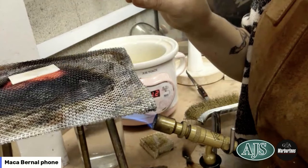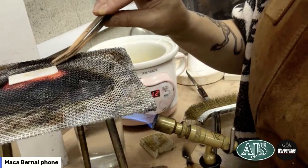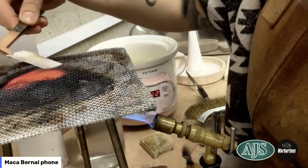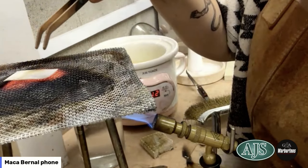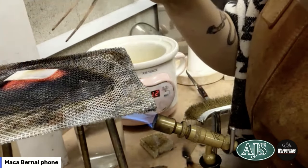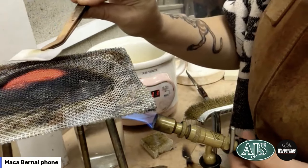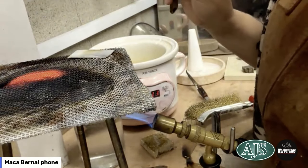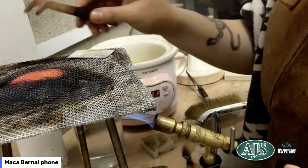This is our last heating up of this piece of silver. It's been at dull red for about two to three minutes. Just monitoring the colors on top — you've got to be quite sensitive to the changes in color because that's what indicates temperature. Now we're ready. I'm putting it to one side, letting it cool down, getting it ready for quenching. I won't turn my torch off because I'm going to use it straight away.